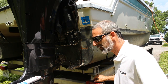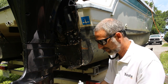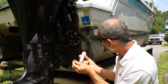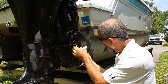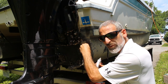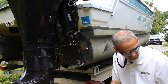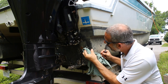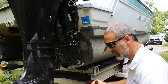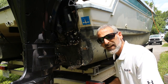Here's a really simple, quick, and easy fix to patch these up. What you do is get some new screws and some 3M 5200 — this stuff works wonders. Give the screw a dip in the 5200, then take the tube, put it up against the hole, and give it a squeeze to force some 5200 inside that hole. We're simply going to replace the old melted-away screw with a new screw. Whenever you're using 5200 on your boat, make sure you have a rag handy because the goop gets everywhere — just wipe away the excess.